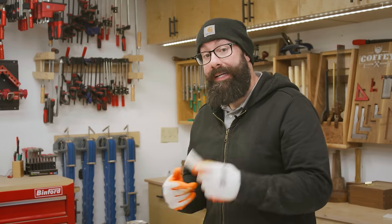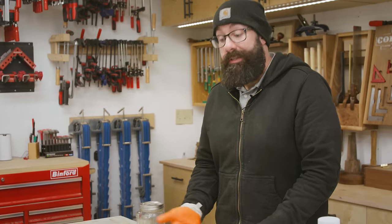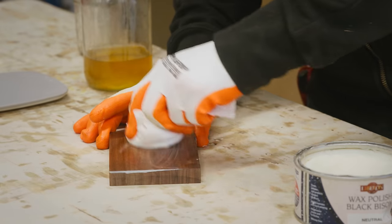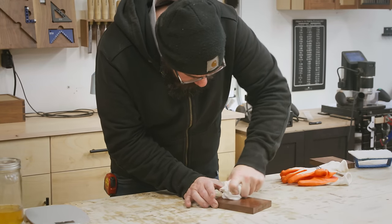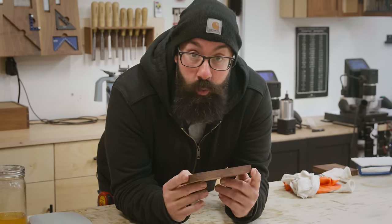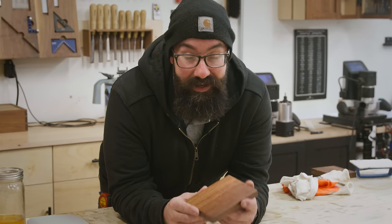The sixth coat is on and I'm going to knock it back again with the white Scotch-Brite pad just to even out the sheen. Very realistically you could be done at this point and have a beautiful looking piece of wood. But I'm going to apply this furniture wax — it's not necessary, but it takes it to the next level, feels incredible, and gives it some added durability. I'm going to let it sit for 20 minutes and then buff off the excess. This is stunning and it feels incredible — it's the best feeling finish and really the best looking finish of the three. I wish shellac was more durable because I'd use it on everything, but it's just not very durable. It's very pretty and feels incredible, so it's really only good for light duty and decorative pieces.